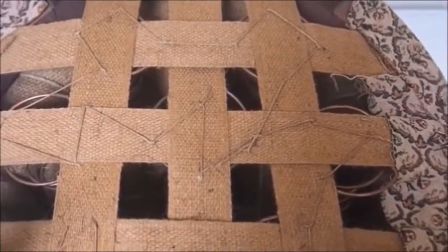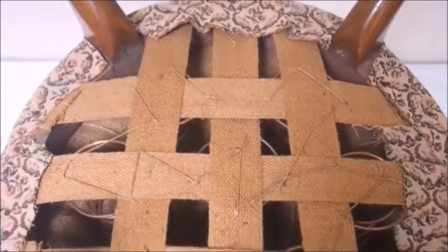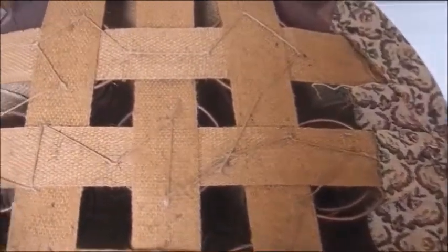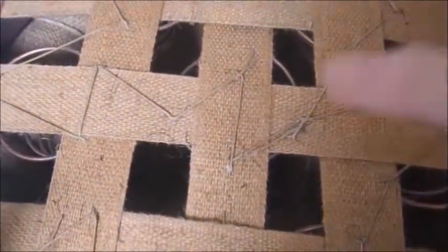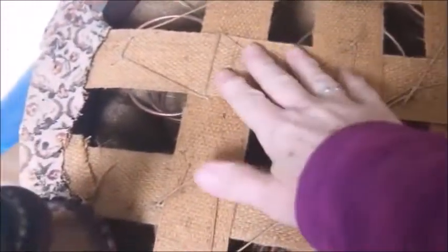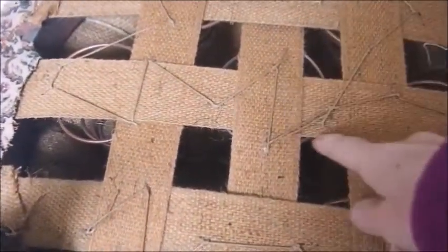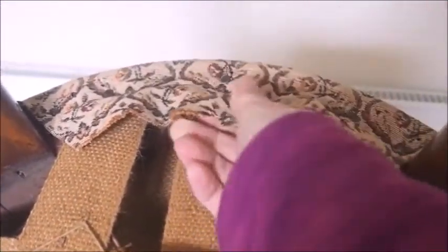I'm not going to replace the webbing unless I get inside and really feel I need to, because it's still quite firm and the customer's happy with how it springs. You can see how the springs are tied in four places. The chair would be on its feet and you would work from inside. These webbings would have been pulled tightly - they've lost some firmness with wear but they're not perishing, so I'm quite happy with that. The springs are first tied at the bottom, and if you look at this cloth you can see how the fabric comes over the wood so there's a good amount to pull on.